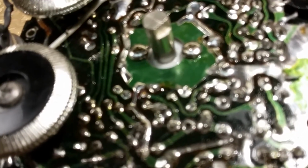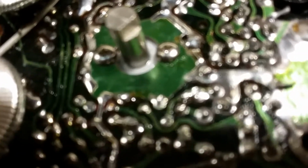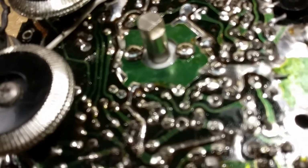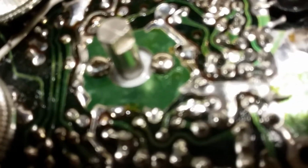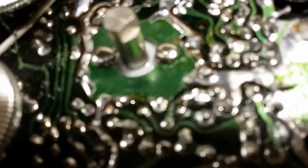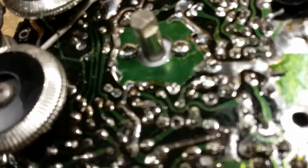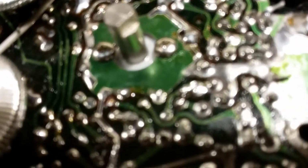I also put a little lubricant on that shaft to make sure that it doesn't bind to that white plastic. It could have been friction. It could have been a lot of different things. But it doesn't seem like it's internal to the tuning condenser, and that's a good thing. I don't think it has anything to do with that. I think it has to do with that junction right there. So that's where I'm at. Thanks for watching.